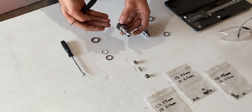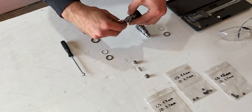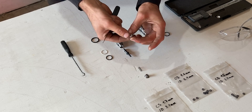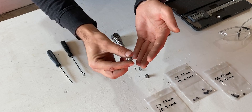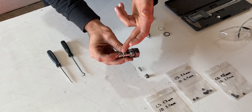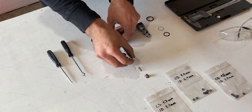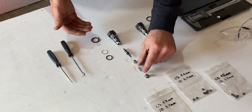This will allow your machine to be free-wheeled and or pushed around without any restriction throughout the hydraulic motor. When I take this piston back out, the next thing that lies below the piston is the ball bearing. Another indication for a weak hydraulic motor would be a worn out or damaged ball bearing. When you inspect this ball bearing you do not want any flat surface throughout its diameter where it seals within the valve body — it will be placed inside where there is a machined surface for it to sit in. To push the ball bearing and the piston up into the neutral position we have a spring.